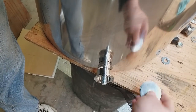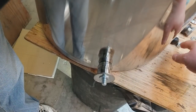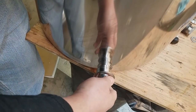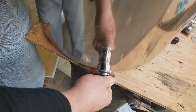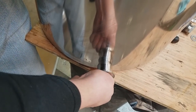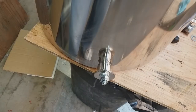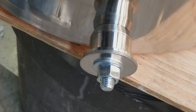Next, take your ferrule with the bullet mandrel and shove it in there. Take two of the large fender washers, the regular flat washer, and finally the nut, and thread that together snugly. Once you've got it about hand tight, grab it from the inside and outside of the pot and wiggle it in a circle just to be sure that everything is well centered. You can see how the bullet mandrel is not quite making it all the way into the hole yet.